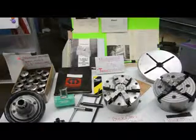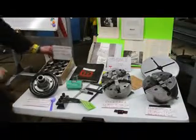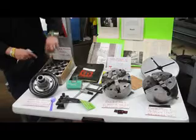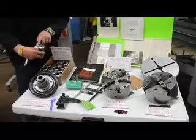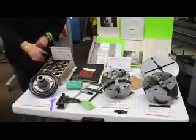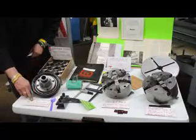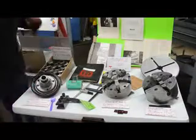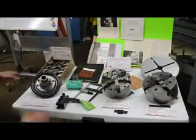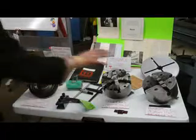What you're seeing here is a Hardinge and Monarch selection of what we call 2J collets. There are various different brands and sizes here. The two main brands are either Hardinge or Monarch — about 90% of them happen to be Hardinge. What we're coming off of with a 2J-style collet chuck is a 2A D3 model — that's a Hardinge Brothers Speed Chuck, which has a D13 on the back side. So we have a D13 direct mount on all of these chucks.